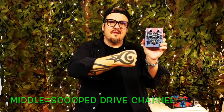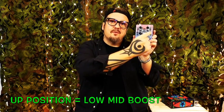Let's start with the clean, then the dirty. Clean channel, you got a volume. Around where it's set now is somewhere around unity gain, which is, of course, same volume in as same volume out on the clean tone.